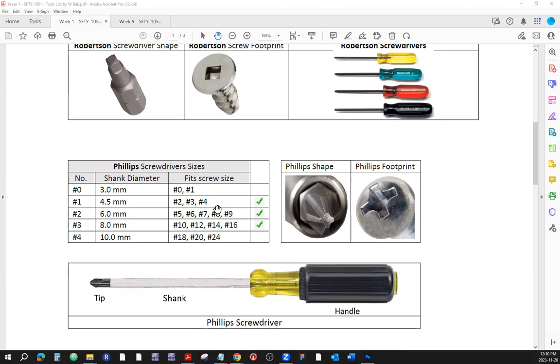There will also be screw sizes, which we haven't gone over, but I'd encourage you to investigate. For example, number six screws — these are the screws that mount the assembly of a switch or receptacle to the box. If you're missing those screws, get the ones from the closet that say six thirty-twos. So 'six' is the size of the screw, and 'thirty-two' is the pitch of the thread.